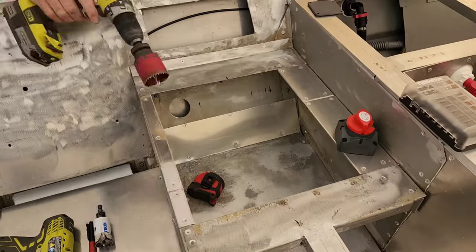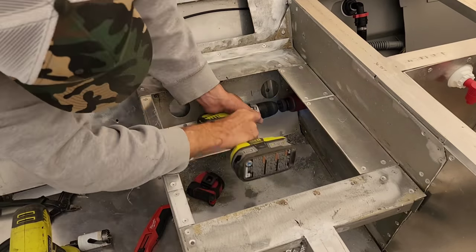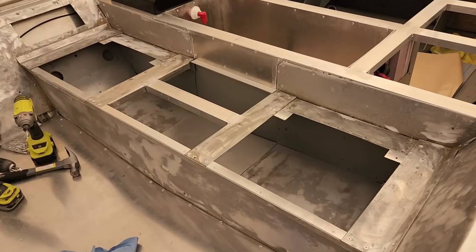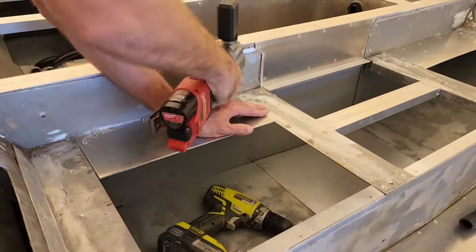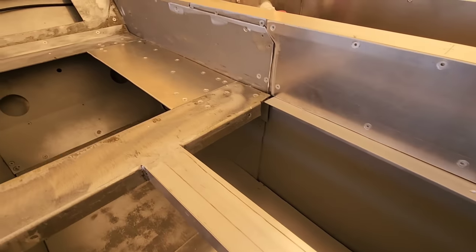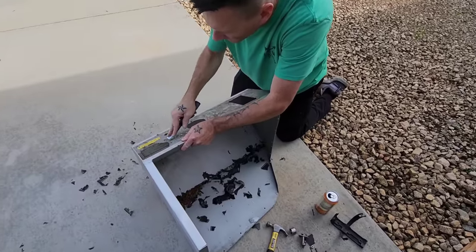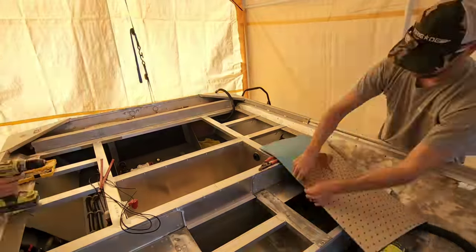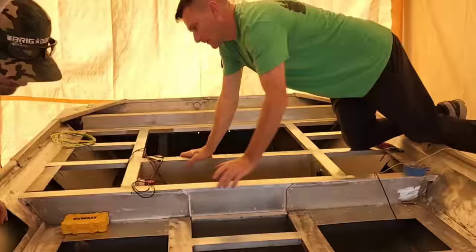Bouncing back to the jump seat area, I did some sheet aluminum work inside the storage compartments. I also cut the holes for where the fuse box and the wiring would eventually go. I reinforced the framework around the jump seat area and then firmed the openings around the perimeters with 090 sheet aluminum to accommodate the new jump seat lid sizes we would mount in place. Chris got to work on the console, removing the steering components and scraping off the factory decals. I began running HydroTurf in the bottom floor of the jump seat storage area, and then Chris began wiring in the back deck area.